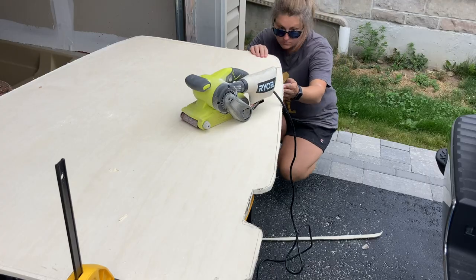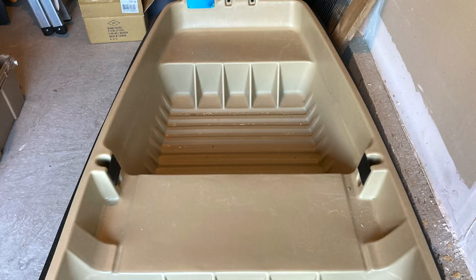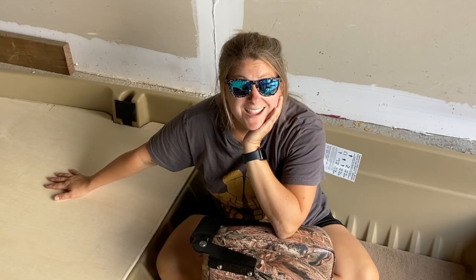I'm at the end of my day. I ended up beveling underneath all of the edges because the boat is on an angle — I wanted the plywood to fit really snug, so the edges had to be on an angle too. The next step is to cut in my trapdoor, and I can't mess it up because I only get one shot.